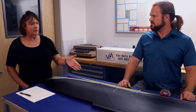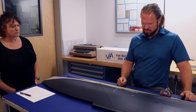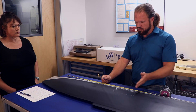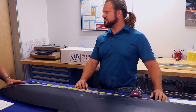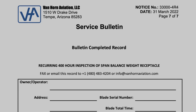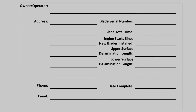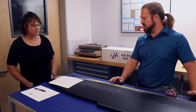Can an operator do this inspection with the blade installed on the helicopter? What kind of conditions do they need for best results? We strongly recommend taking them off the helicopter so that you can put it on a nice flat surface and preferably be in a quiet area so you can really hear the tone changes without a lot of background noise. When a customer does this tap test and finds a delamination, what should they do next? There's a form at the back of the service bulletin that we ask operators to fill out to note the length of the delamination, the number of hours on the blades, and a few other items, and send that information in to us. That way we can track these delaminations for the whole population of blades, make sure there are no anomalies, make sure everything looks consistent, and keep everybody flying safe.